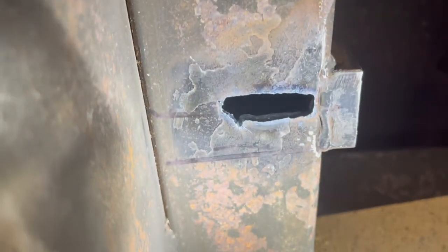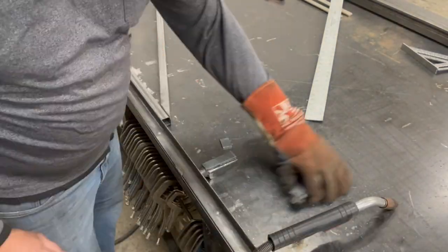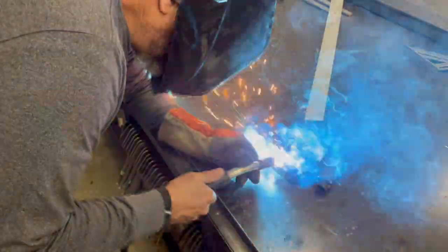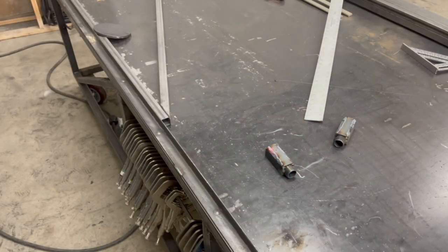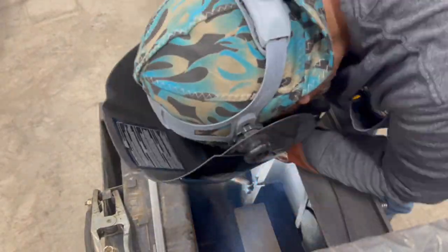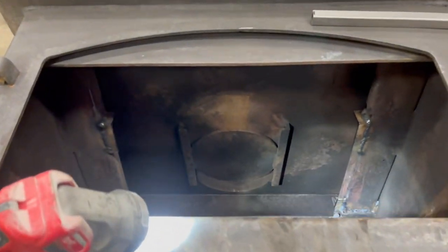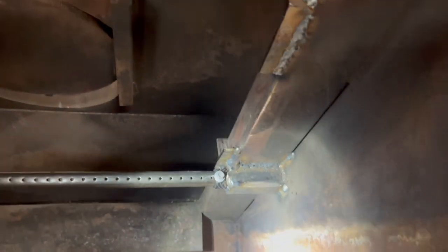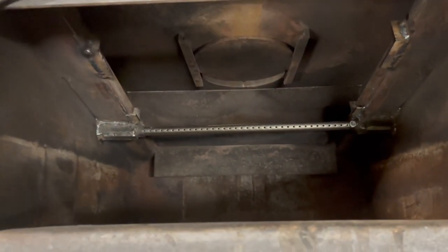Here's a close-up view of those slotted holes — that lines up pretty good, I'm happy with that. Finishing up the welding on our tube brackets, welding those two brackets in place. The stainless steel tube goes across; there's air coming in from both sides and that just adds that additional combustion air. It is stainless steel so you can replace it, but it will hold up to the heat really well. You can see that top baffle bracket as well is welded in place, and that tube slides in the pipe on each side and is secured with a screw.